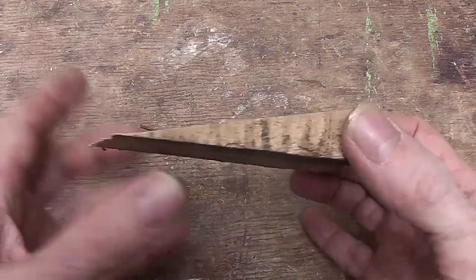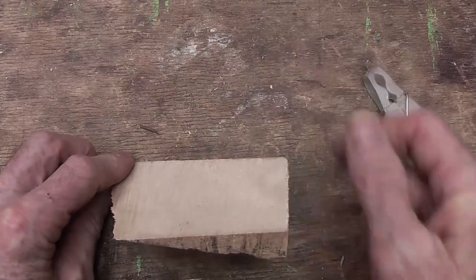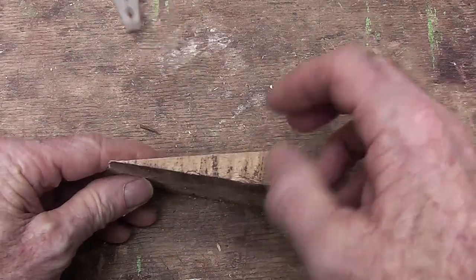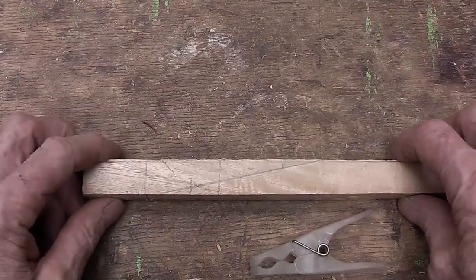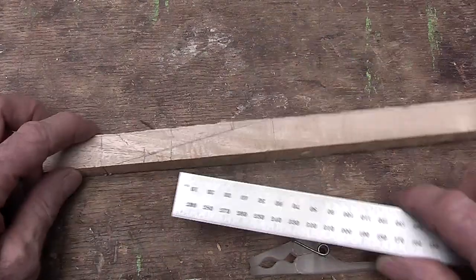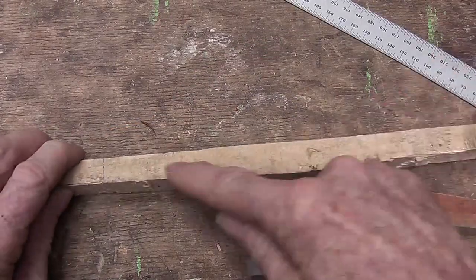The first ones I made, I got a wedge of roughly the right dimensions and cut and split those. That's how they do it commercially — they make the wedge, run a router down to make the grooves, and then slice them off in pieces. However, I've run over those and that one is not quite the dimensions I want — a little bit deficient. So let's do them on a stick: basically 80mm long, 25mm wide, five at the other end, get the angle right, then replicate it mirrored so I only have to split it down the center, chop off those two ends, and we've got one ready to split.